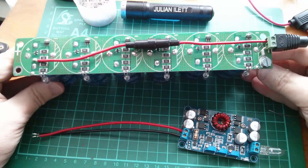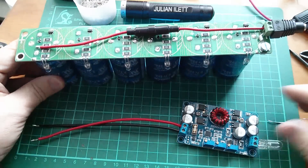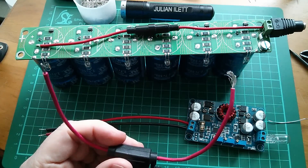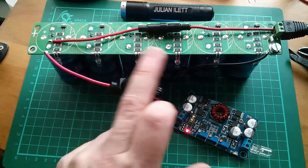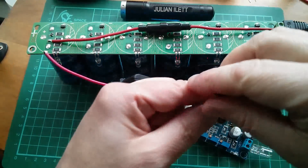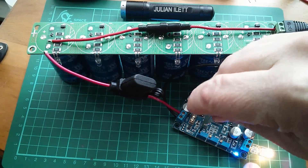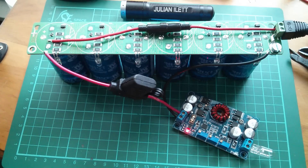Before the voltage gets too high, I want to solder on my buck-boost converter. I've scraped a couple of positions and I'm putting a fuse holder in here with a 10 amp fuse. The fault light was on because the voltage was lower than the battery protect circuit threshold, but I adjusted it and the red light has gone off, the blue light has come on indicating output is on, and my little light bulb is on.